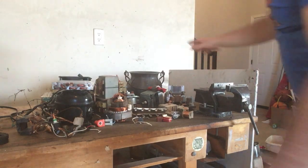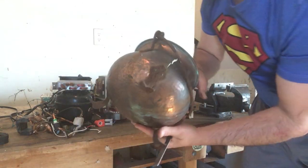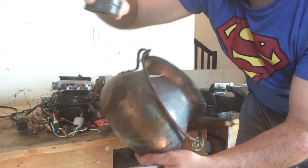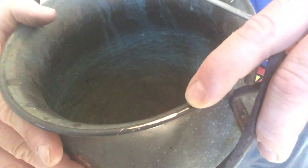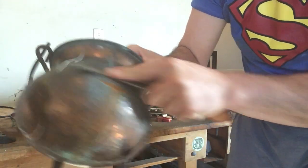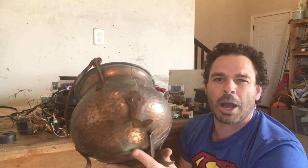All of these other items, you do see a mix. This one is a mix — same color. If I put a magnet to the legs, it sticks; it sticks to the handle. But if I scratch the pot, you can see right there that is copper, and scratching this part, that is copper as well. You do want to make sure you don't just brush the top surface — put a little effort into scratching because some items have a small coating of copper overlaid, especially decorative plates. I have seen people bring this kind of stuff to a scrapyard and get downgraded tremendously because of the steel on it.